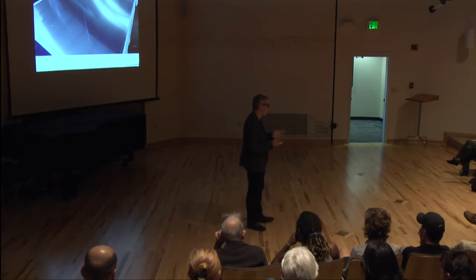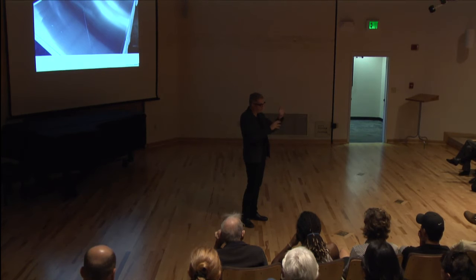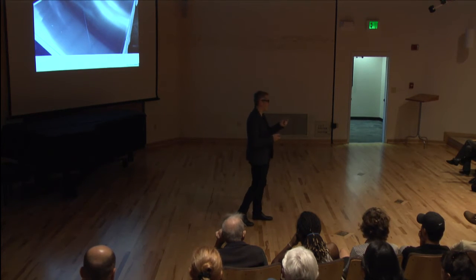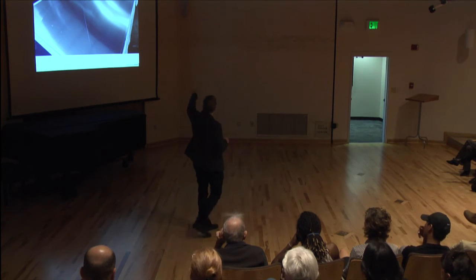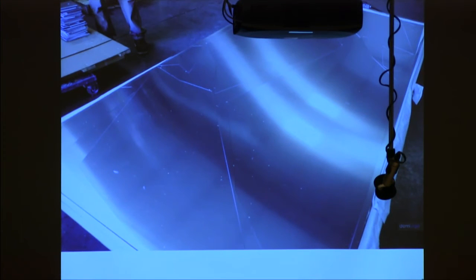And one advantage that the software has as well is that it can tell us exactly how much material we need. So if I say I want 5 more of those pixels, it will tell us immediately how many more sheets of material we need. We cut these pieces out of 4x8 feet aluminum sheets. I think it's 3/8 of an inch thickness. So you see here one of those sheets, and you already see the pieces cut. They're cut either with a water jet cutter, a laser cutter, or a CNC machine, so you can pick which one is the most cost efficient. With this one, we used the water jet because it was the most cost efficient, since the pieces don't have too much detail. We decided that was the most efficient way to do this.